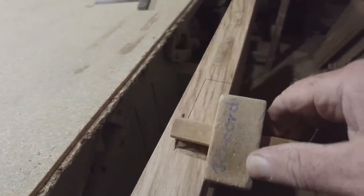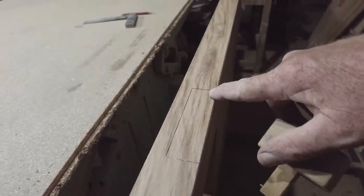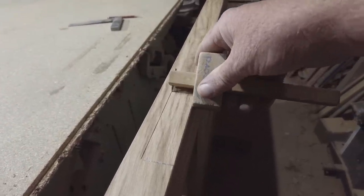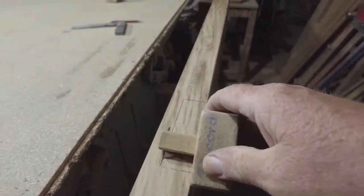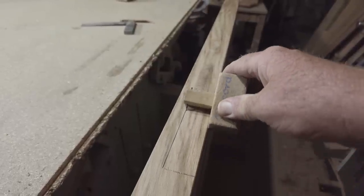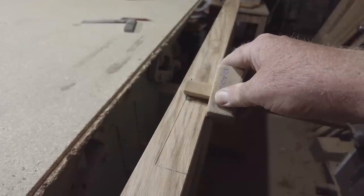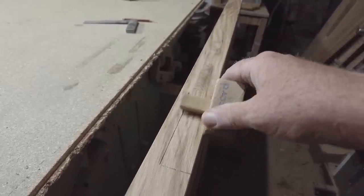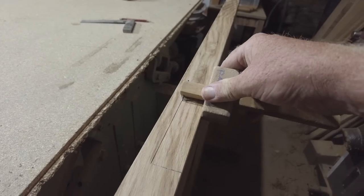All right, and then coming over here, then I'll show you on here. That goes in there. I've already done that mark. Little trick though, when you're doing these setting out, if you're ever doing a setting out hinge, guys, or ladies as well, on your furthest line away from you, push a little prick into the line, at the end of the line. So when you push your marking gauge through, it stops. It always stops at the line, okay? It's a good little tip to learn, and a good way to keep doing when you're using marking gauges at all, right? Saves you going pushing right through and making big long lines you don't need to have going into the timber if you're keeping it nice and tidy. It's a better way to work.